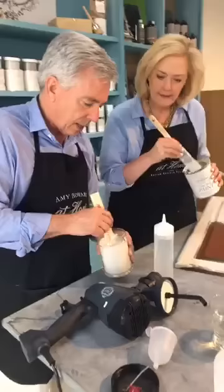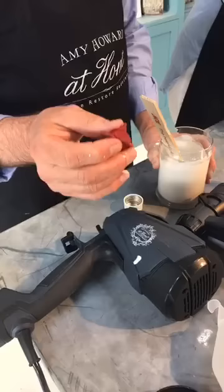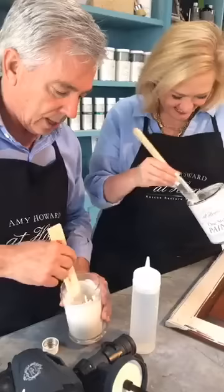thick. Now, the nice thing about our sprayer is that it comes with two different tips, and the orifice on these tips. This one is the smaller one. This is good for more like clear sealer, things like that. It's got a very thin viscosity, where if it's thicker, the tip that's on here has a larger one. What does viscosity mean for a lot of people that have not worked with paint? That's a fancy word for thickness. It's how thick or how thin it is.